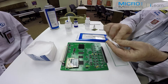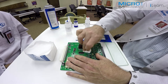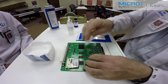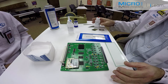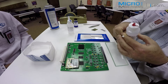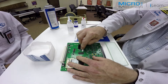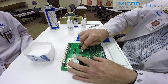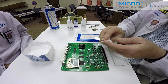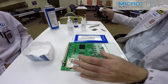I'm now going to take a clean dry gauze sponge and absorb that contaminated Conditioner A, a little slurry of debris left behind. Next step will be to locate a cotton tip applicator, the CSP-1, and Conditioner A, again flooding the surface with the Conditioner A, and then scrub with the cotton tip applicator. You'll notice it will come up a little dirty. Take the dry gauze sponge and absorb the excess Conditioner A that has the contamination entrained in it.